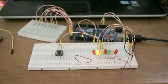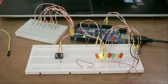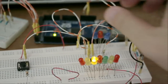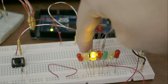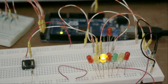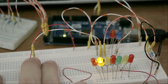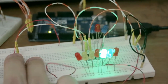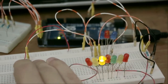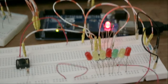This is extremely useful for scanning the LED matrix. There is one problem: there are ten outputs but the LED matrix only needs eight, so we have to ignore two. To resolve this, I've wired the reset pin to output number eight. As I go through my eight outputs, the moment I hit that one it basically resets over. The last two outputs - these two blue ones - no longer light up because the internal state resets before it gets to them. That is one electrical way to work around the problem of there being ten outputs.